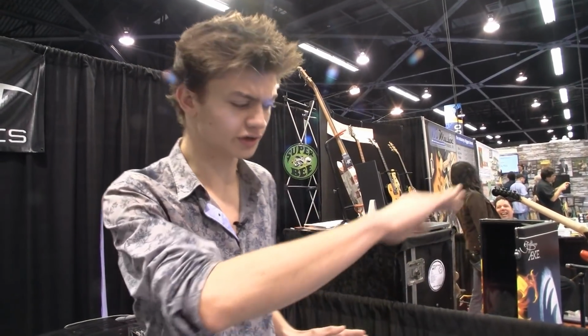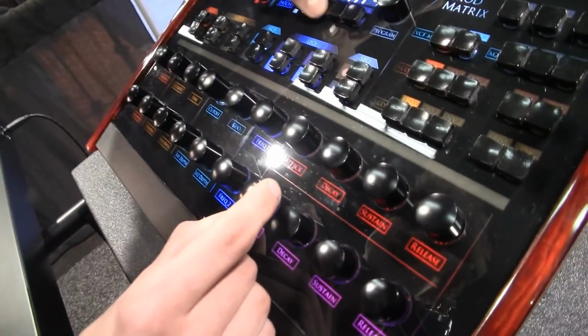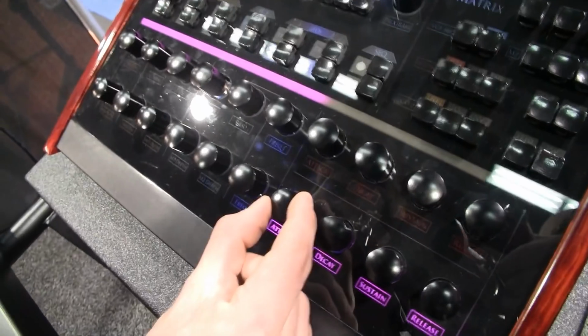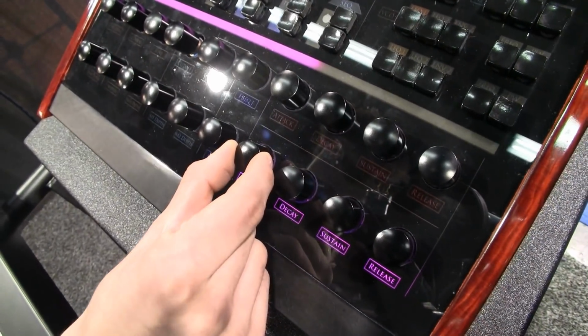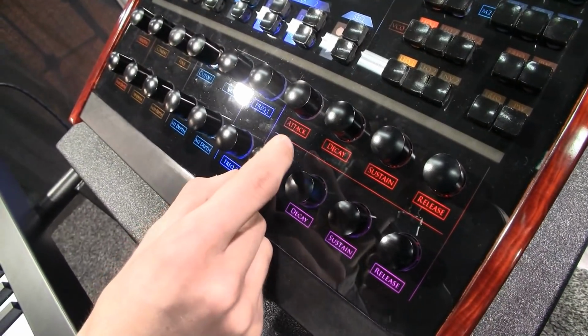Now the Curtis envelopes they initially used, that chip was long discontinued, but we're able to use a digital emulation with 32-bit integer processing to simulate the original Curtis profile in real time on each voice card. Each voice card has its own digital processor, so while all the sound is analog, the control voltages are generated from digital routines. Right, okay. We've even simulated the variance between individual envelope generators. So on this patch, if I crank up this attack time, watch this. We can add some spread between the envelopes, and we get this effect.